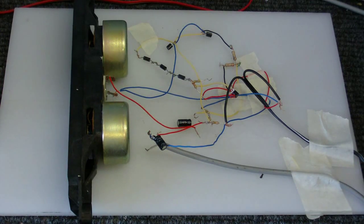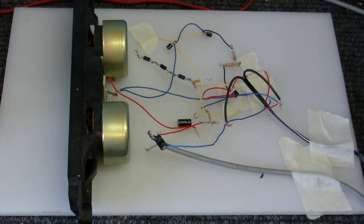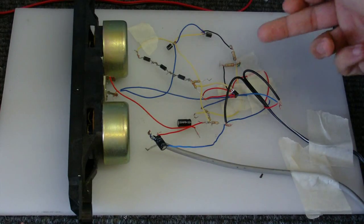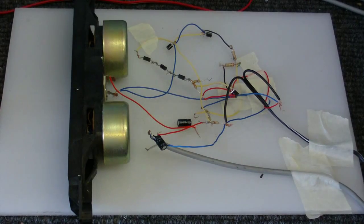Now I'm going to talk about this a bit more. As you can hear, the sound isn't perfect — there's a little bit of distortion. I'm pretty sure it's just a biasing problem, and of course because I'm not using matching NPN and PNP transistors either. On my previous attempt at building an amplifier from my own design with discrete components, it was a complete fail — it just didn't amplify very much at all. This one amplifies quite a lot.